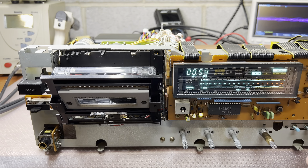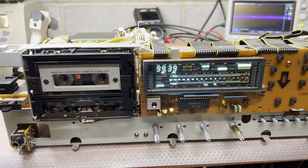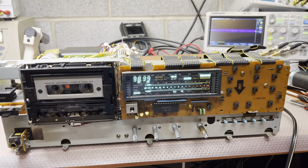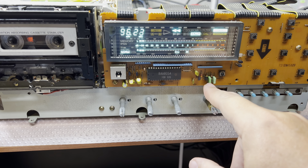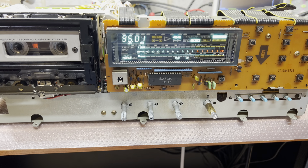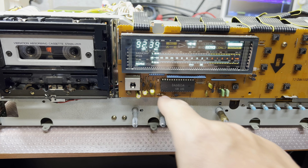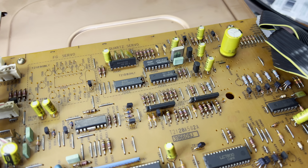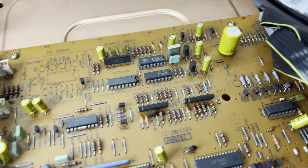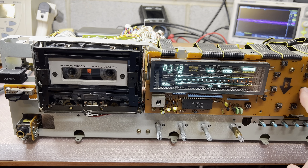I will show you results — I will show you how the bias and normalize perform with the Dolby B and C circuit. I also see there are like two more capacitors which I've been replacing in this deck on the audio board, so I'll probably replace those too, as soon as we replace the buttons. I'm not sure yet about the power supply — it still works, and this board still works for now. So far, looks like everything works fine.